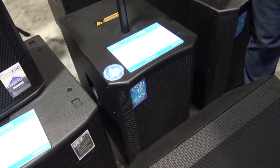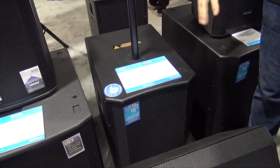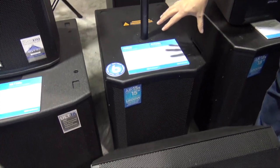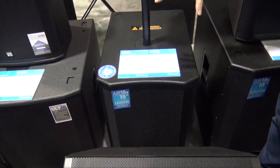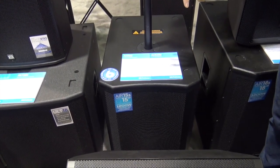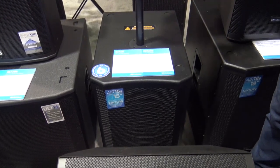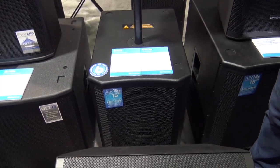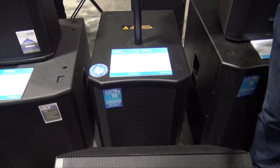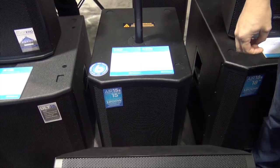The amplifiers on the back have the same DSP capabilities, except we added a few extra tricks. Especially if you're considering this for DJ use — people like a lot of bottom end in the DJ world. We don't want that bottom end being pointed all over the DJ, so we set these up so you can actually run them in cardioid configuration. Take two of these subs, spin one around the other direction, hit a couple of buttons, and the system automatically aligns itself.